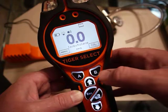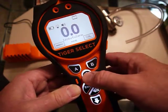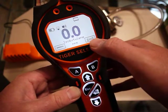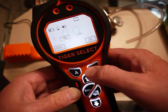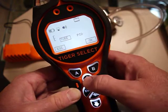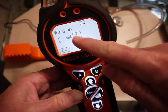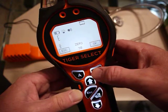My memory is totally empty, so I want to go into calibration. Underneath here, the meanings of these keys change — if this wasn't on calibration I could use the up/down keys. I hit B and that button corresponds to a choice between calibrating to the benzene tube, which is for benzene reading, or calibrating the PID for TAC mode or general monitoring. I selected PID and hit okay. I can either default back to factory calibration or do a calibration done by a person today, so I'm going to do that — I select it and now I'm in calibration.